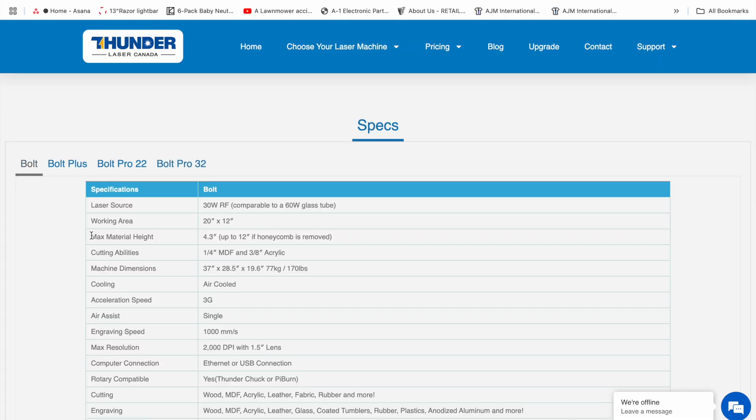When you're looking at different lasers, if you're still in the research space, the various brands will have specifications — how fast it is, the DPI or LPI, how much power, how much wattage your tube or RF laser has. It'll also usually have a sentence telling you the maximum thickness of certain materials that laser will be able to cut. But the truth is it will actually cut more, and I'll show you that today.